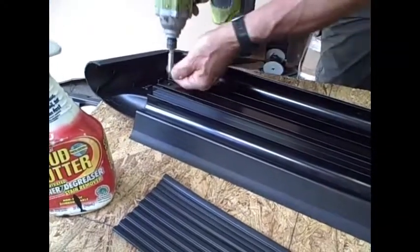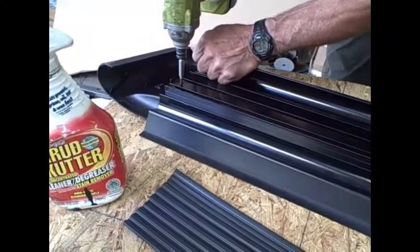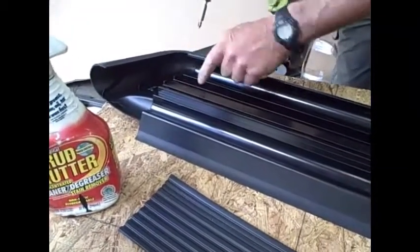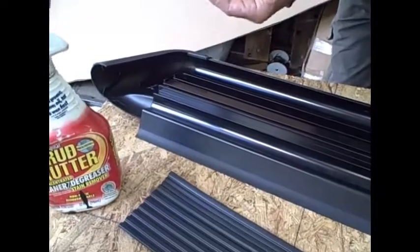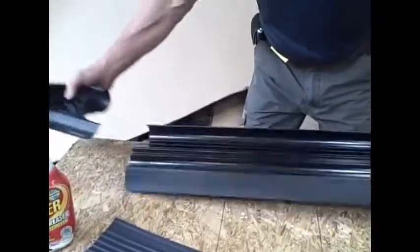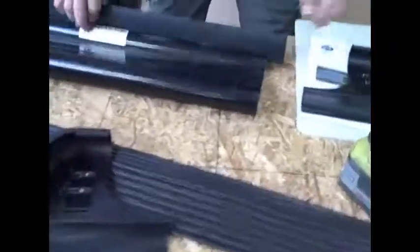This one is a new step and the screws come out, but if it's been on there and weathered, you're going to just drill them out with a nice crisp 3/16th drill bit. Pop the ends off and set them aside.